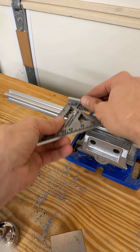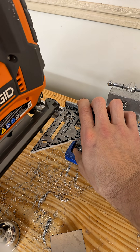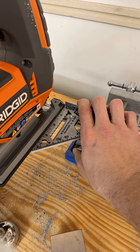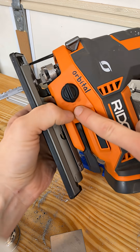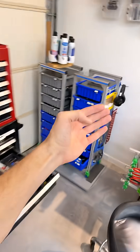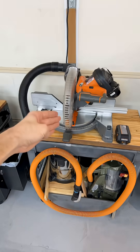If you're just a beginner, then you're going to use a carpenter square and hold that against here to line up the edge of your saw so that you get that perfect 90 degrees. I recommend that you use orbital at a middle level — I have this on setting two. You use that method, and then you can build those things with far less noise and fragments of metal flying around.